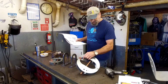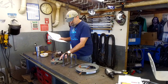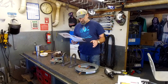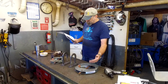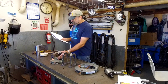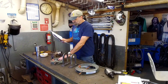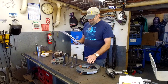And so I have an 8-inch here, which is the number 8, and here is a 5-inch, number 5. They have their name stamped right in. Made in the United States of America. They also have everything in here that tells you the total throat depth. On the 8-inch is 5 3/4, and on the 5-inch it's 3 3/4. And the max force on the 5-inch is 7,400 pounds, and 7,700 pounds on the 8-inch.